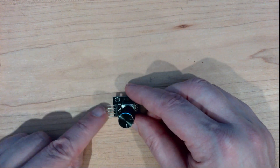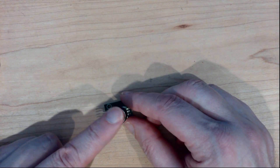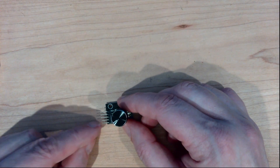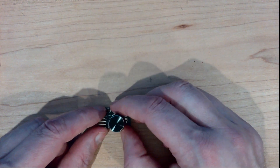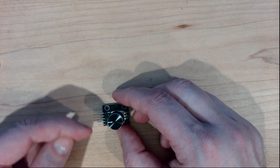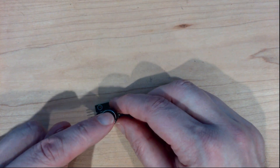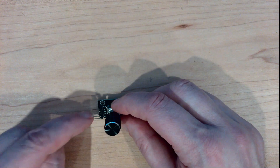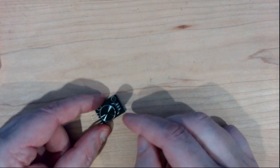On this, you can see we've got pins. It's got ground plus, so it takes voltage to drive this. It's got an SW, which is the push button, and then it has two others for the phase. What happens as we rotate this, it generates pulses on these two so that something decoding this can determine direction — whether you're going clockwise or counterclockwise. And since you get pulses for each one of these detents, you can see not just the direction but how much it's moved in either direction. The SW push button switch goes to ground, which is important when we're wiring it up and when we write the software. So let's go take a look at building an application that uses this sensor as an input.